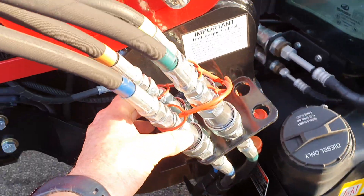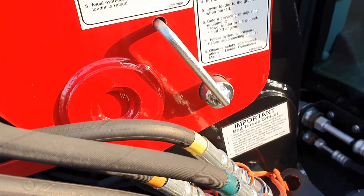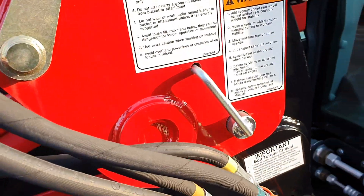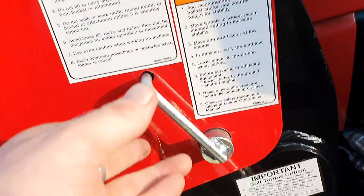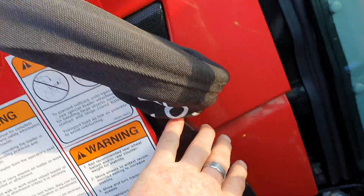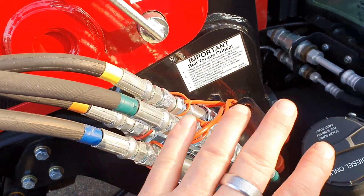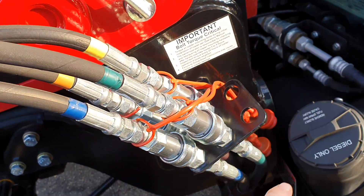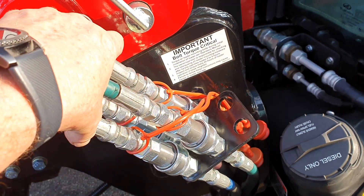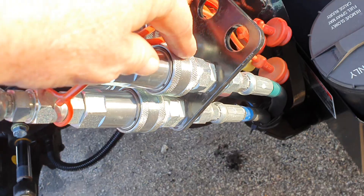You have your color-coded hydraulic lines so you can take the loader off and put it back on with ease. While it's in the air, after you put your kickstands in, you do have these pins — just pull your pins out because it is sitting inside this cradle right up in here. Then back up off the tractor, cut the tractor off, and work the fluid around the loader handle to relieve pressure on the quick connects so it's easy to take them off and put them back on.